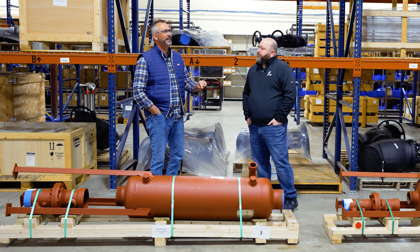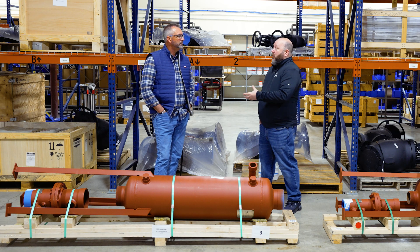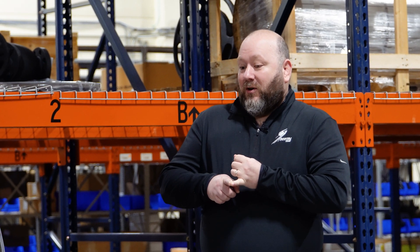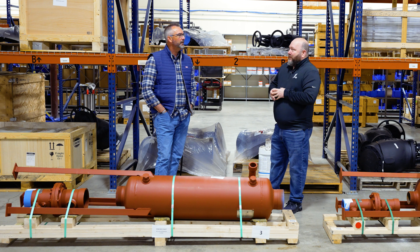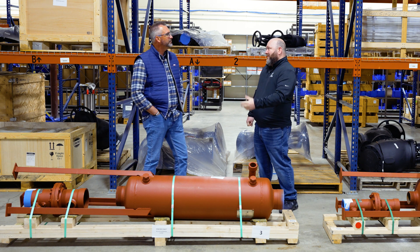Real quick on the drain — what's the big deal if it's hot? There are a couple of different reasons for it to be tempered before it goes to a drain. Most municipalities will require it to be under 140 degrees. One, the design of the sewers in certain municipalities has a temperature rating on the piping, and also the temperature could actually kill the biome that takes care of the waste. So there are a couple of different reasons that you've got to temper that. You can't just take full steam temperature and dump it in those drains.